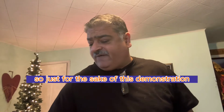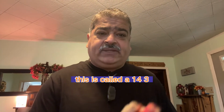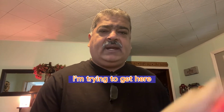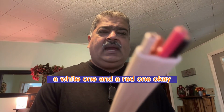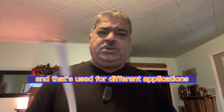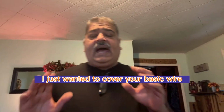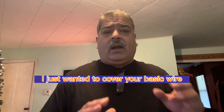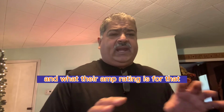So just for the sake of this demonstration, I used a 14. It was cheaper to get it. This is called a 14-3. See how it is? It's got a black one, a white one, and a red one. And that's used for different applications, which we will cover in other videos. Today, I just wanted to cover your basic wire that you have in your house and how you can tell the difference between them and what their amp rating is for that.